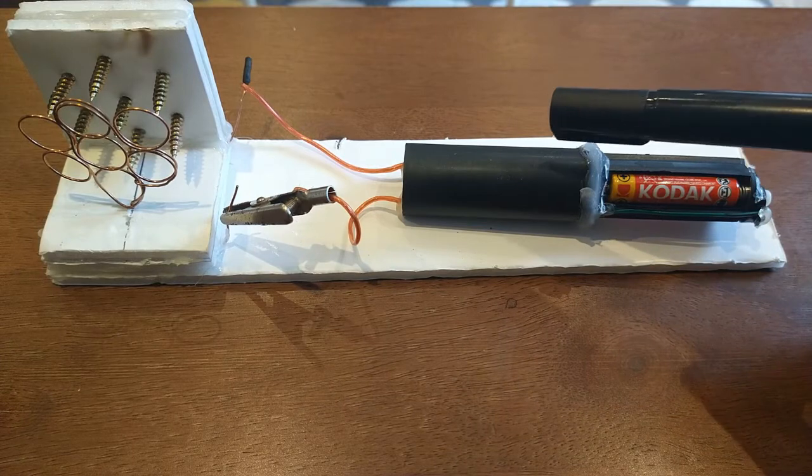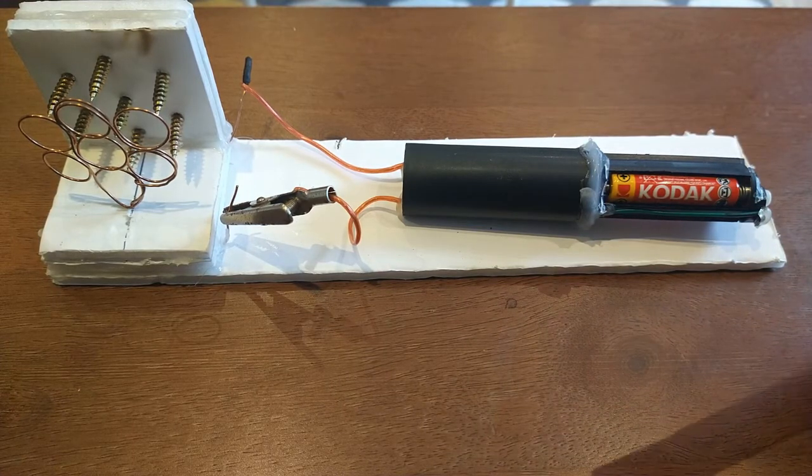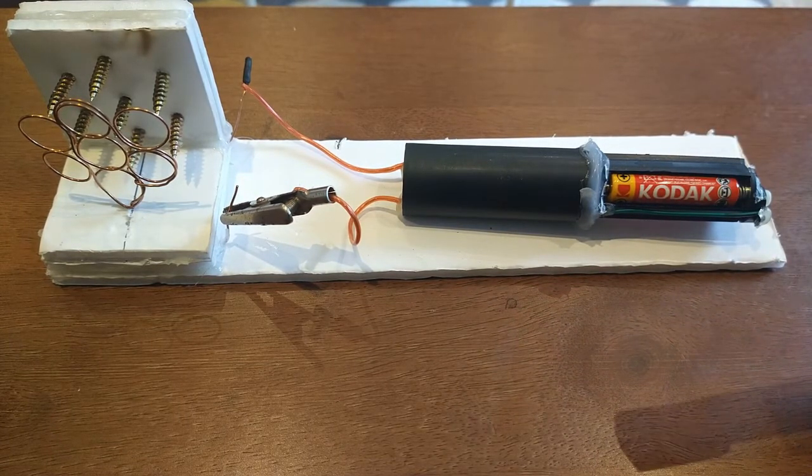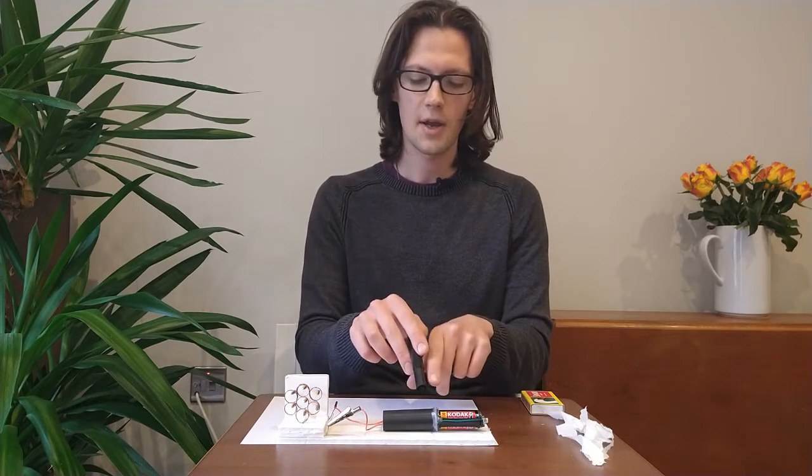These were designed to be used in stun guns. Stun guns are illegal in the UK; however, possessing a module like this isn't illegal so long as you don't try to use it in a stun gun. There's a video by a guy whose name escapes me where he made a little ion-propelled boat using one of these, which is what first inspired me to use it for this project. There's also a brilliant and very funny video by BigClive.com on how these actually work — I'll pop both links in the description. In short, what we've got in here is an oscillator circuit turning this into AC current, and then a series of step-up transformers to step the voltage way up into the kilovolts required for ionic wind to be produced.